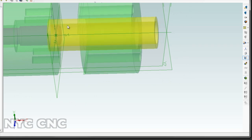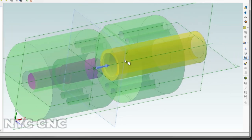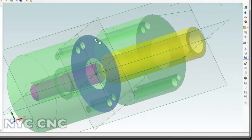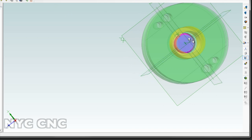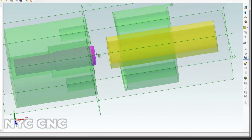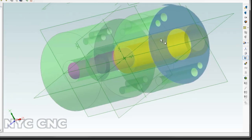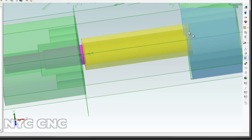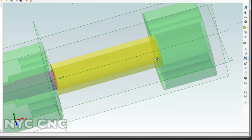In the previous video, I talked about the question of how to handle the copper jacket once it's formed — would it be stuck on the purple punch or stuck inside the yellow die? The answer, and full credit to a fellow Dave over on the Cast Bullets forum, is to make the yellow die hollow, so that as you continue to form cups from blanks, the cups will just stack up in the yellow tube and eventually pop out the top. I'm already thinking about turning a larger ID or a taper so that once blanks are halfway up they're loose inside. Or perhaps cutting a little window in there so they fall out — that would be pretty cool. I'll worry about that later, but it's an important design change.